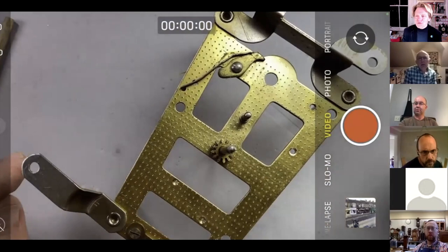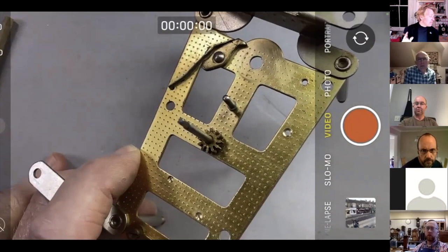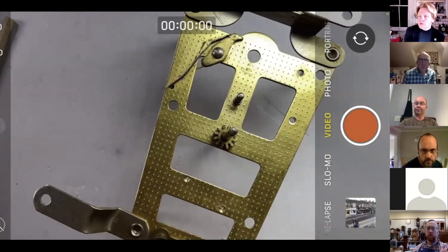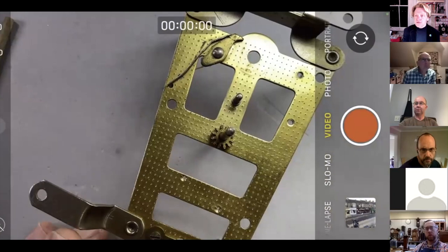I think the answer to that, and again, if anybody's in sheet metal production or industry, they probably know this answer, please let us know. I think it's to do with stress relieving the plates. You'll know this material is rolled brass, unlike that plate that I showed you before, which is cast. This is rolled, so it's stressed. You've got a sandwich of material that's in tension and material that's in compression. So if you treat one side of this, say you filed off one surface, the material will begin to curl up like a bit of paper.